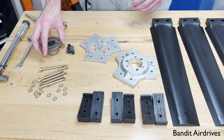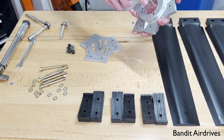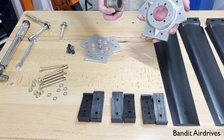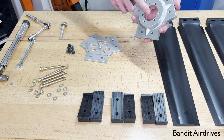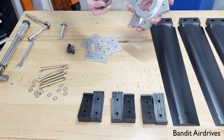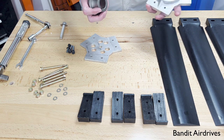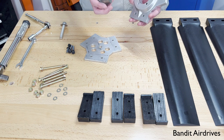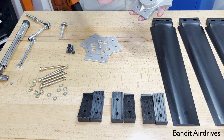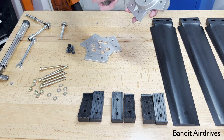The first step is to make sure that the mating surfaces of the bushing and the inside of this front hub are completely clean. Usually the aluminum hub comes clean from the machine shop, but oftentimes when these bushings are packaged they have some oil. Be really careful to wipe this off — use a clean paper towel or a shop rag and some alcohol. Make sure it's really clean. You don't want any sort of anti-seize or lubricant of any kind between these two parts.